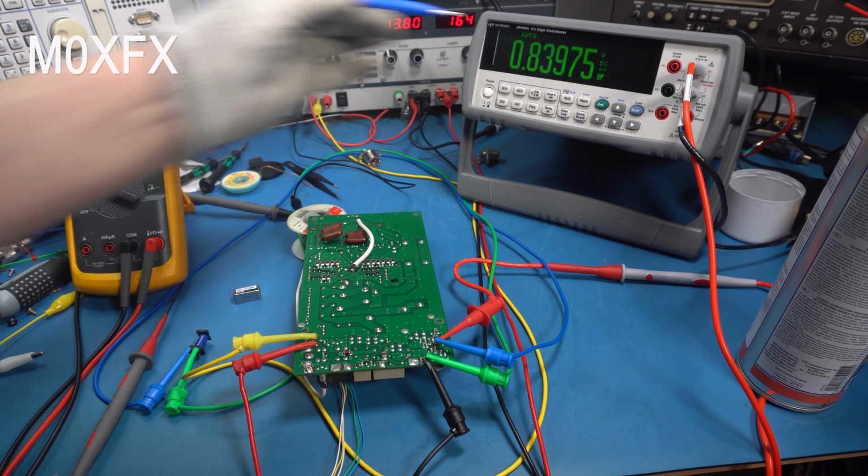Very good. Okay, so that's 12.78. So that goes high, this thing's supposed to switch off. Now I've got a feeling that that voltage, 12.78 volts, is slightly too low. So I think we need to take another look at the circuit diagram. On the collector of this switching transistor, we've got about 800 millivolts, which I think is wrong, because that will still allow current to flow through the reed relay coil. Now, these transistors are pre-biased to work as a switch, so they switch on and they switch off. What I suspect is the voltage at the base here isn't high enough, because of course this has to go high, and I think it's only by a fraction.